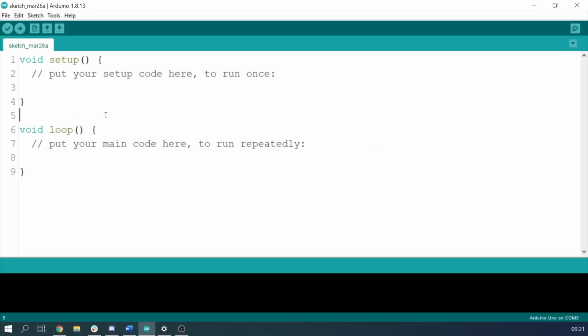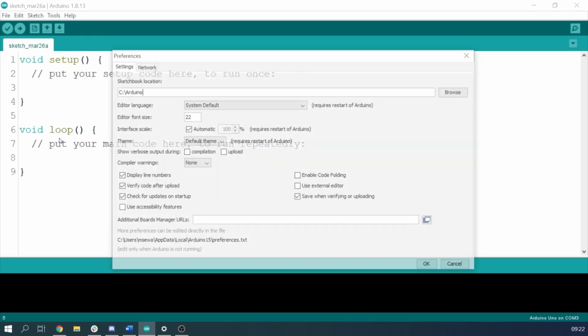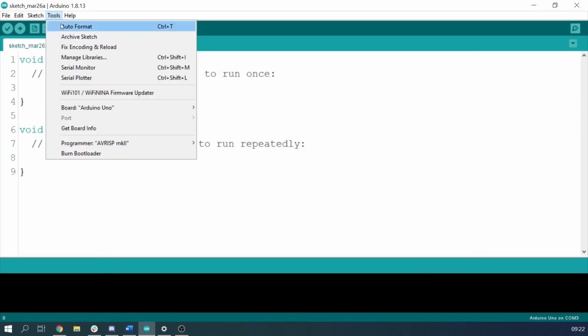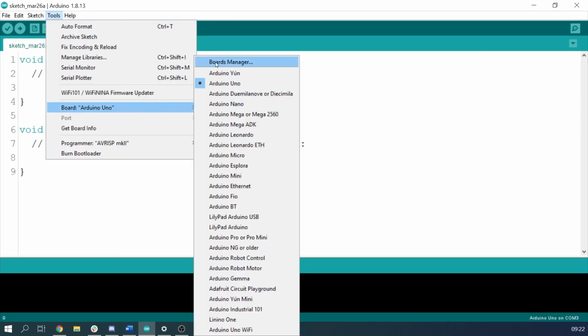So to get started, we need to open the Arduino IDE. If you don't have this installed, it's very straightforward to just download it from the Arduino website. Inside the Arduino IDE, go to File, then Preferences. In the Additional Board Manager URL field, add the following link, which is available in the description. Then press OK. Now, in the Tools menu, select the Board Manager, and then search for Pico.